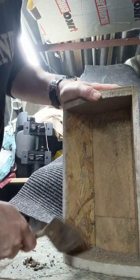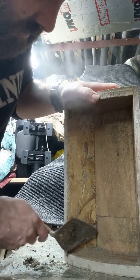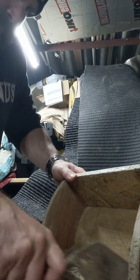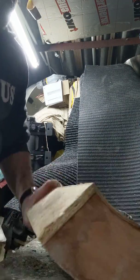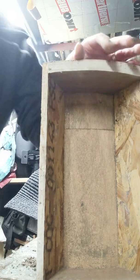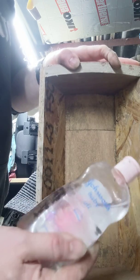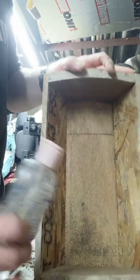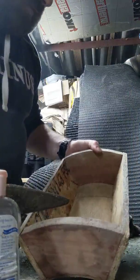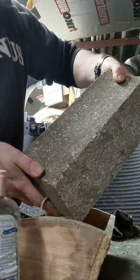So that, a good friend of mine told me, look at that, with the formers, there's a shuttering joiner, carpenter, Canadian, told me to coat these with baby oil. So don't use a scented one, because when you come to fire up the furnace it'll stink. But ta-da, baby oil, use that. I still had to unscrew them because I was that terrified of breaking them after all the work. So I did unscrew them, they popped out brilliant, and you see they came out like that.